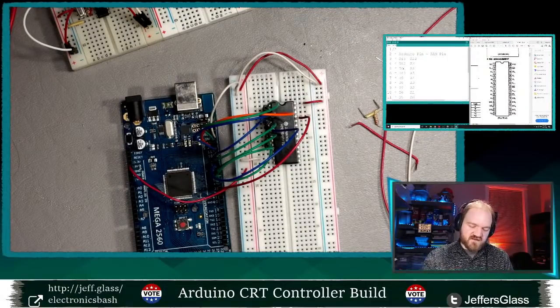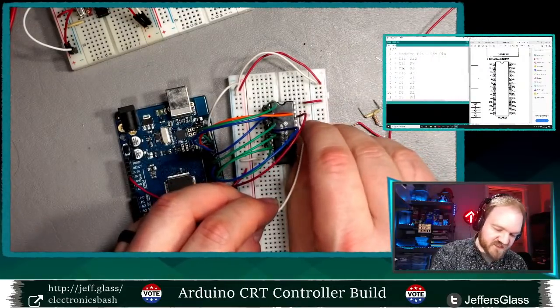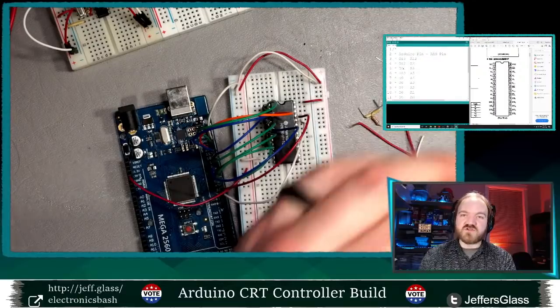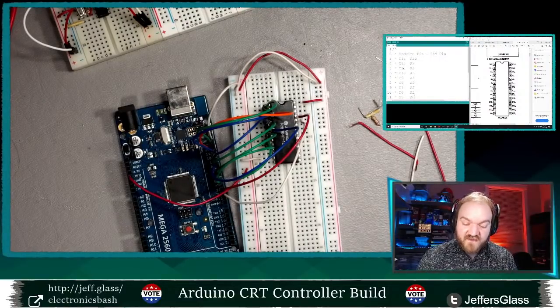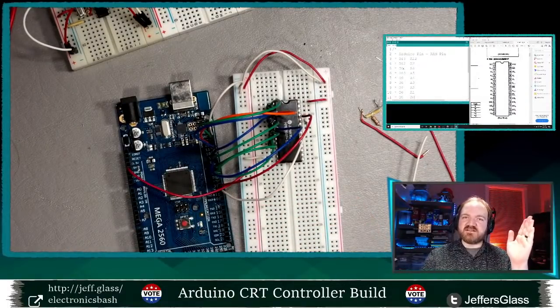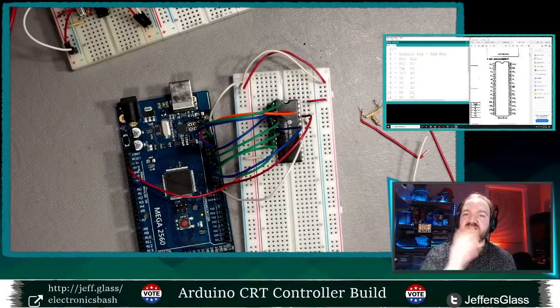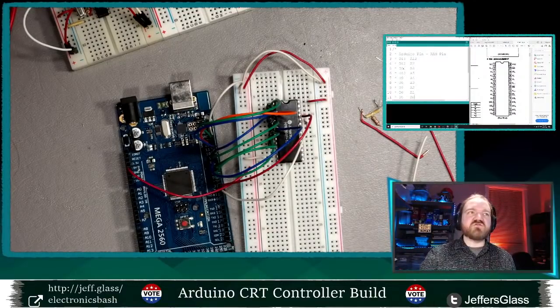So I don't think we ever talked about NeoPixels here on the channel, except maybe in passing. But for those who haven't encountered them, NeoPixels or WS2812s or their various family of things are a super cool individually controllable LED. It solves the old problem of, okay, I want to control 500 LEDs with my Arduino, but I don't have 500 signal lines to do pulse modulation on each of them. What do I do? So WS2811s and 2812s and 2850, it's a whole family of 2800 chips, solves that problem by basically you string them together in serial, one after the other, and there's a protocol that you can send out at very high speed, like 800 kilohertz, that passes through the whole line, and within it, each individual pixel is addressed. So you can say, okay, pixel 1 be this green, pixel 2 be this red, pixel 3 be that green again, and so on. And so you can string together hundreds of these pixels in a row and control them without having individual control lines.